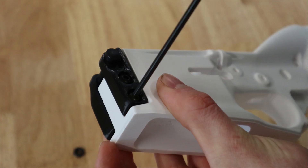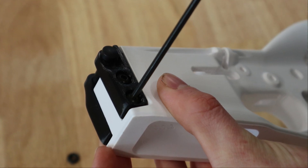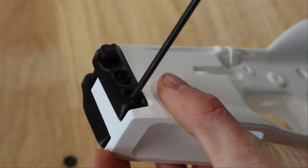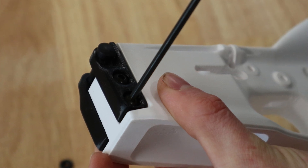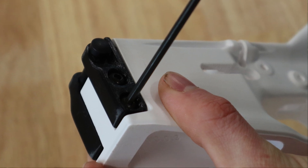The second thing you can see is when you're tightening screws down, like the front takedown pin plates on my lower receivers. I did some experiments using Overture Easy Nylon, and even carbon fiber nylons and other filled nylons exhibit this property to some degree. But if you torque screws down, the plastic will actually flow away from underneath the screw and nut, and you'll end up having to constantly re-tighten your screws to keep them tight.